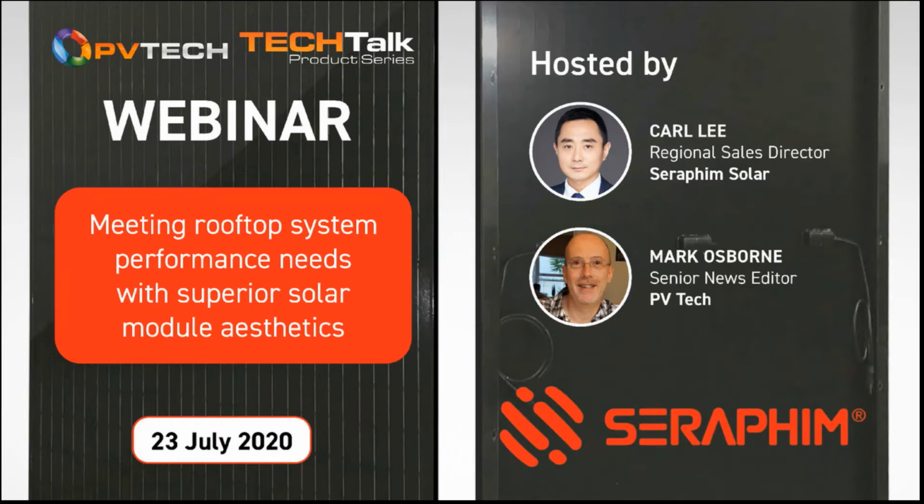In our test labs, we mainly do three big groups of tests: performance testing, environmental testing, and safety testing. In performance testing, we can do maximum power verification, TC, and LID. In environmental testing, we can do UV pre-treatment, humidity freeze, PID, thermal cycling and damp heat, hot spot endurance test, and highly accelerated temperature and humidity stress test, which we call HAST.